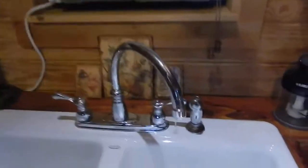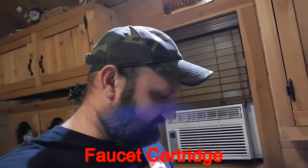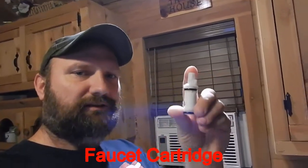How y'all doing today? Well, today I've got a little project here at the homestead. I've got a leaking water faucet. I'm going to show you how to fix that yourself. It has a water stem right here, and I'm going to show y'all how you can take it apart, take the O-ring inside of it, turn it around, and put it back in, and it won't leak.